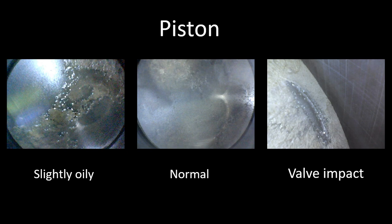The reason for that is there's a buildup of deposits in the exhaust valve guide that causes the valve to stick, making the engine run bad. When you shut it off, the cylinder heat soaks a little bit, the clearances open up, and the valve starts to function normally. This is a more common issue on Lycoming engines due to the way they cool their valves. In this continental engine, it was mostly due to the airplane being used in a flight school — running full rich a lot at low power settings, which are recipes to build up lead deposits. When the exhaust valve hung open, it contacted the piston and left that mark.